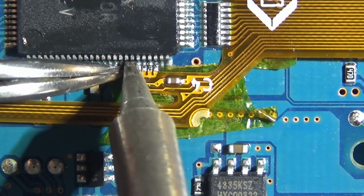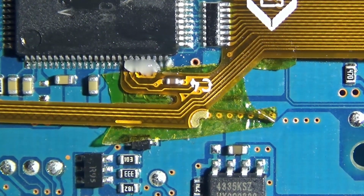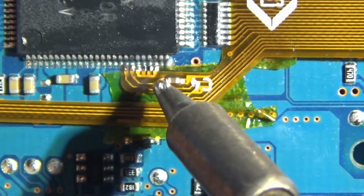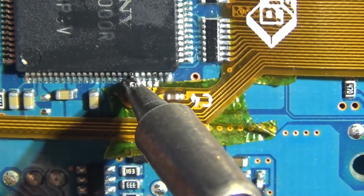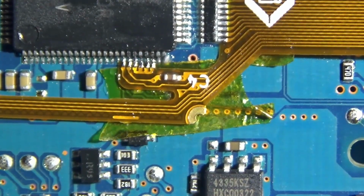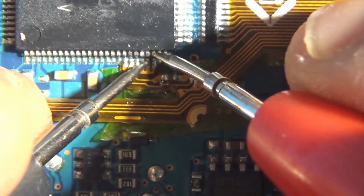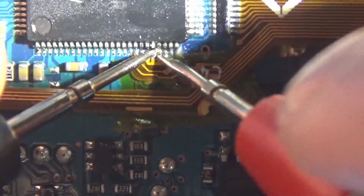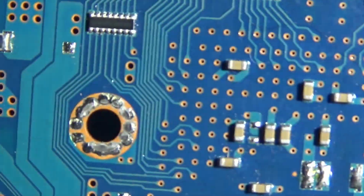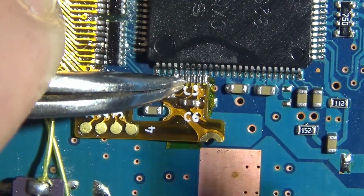There's no wiggle room. If you have to straighten those pins, you have to straighten those pins perfectly. They will bridge on the bottom side, like from the teeth, whatever. These pins need to be straight. Don't be too crazy drag soldering or anything like that. If you knock a pin out of alignment, you're gonna have a really bad time. It is not fun having to straighten these out, like, at all. They're very sturdy pins, so it's hard to knock them out of alignment, but if you do for some reason have to straighten them, it is fucking rough. Yeah, that looks better.